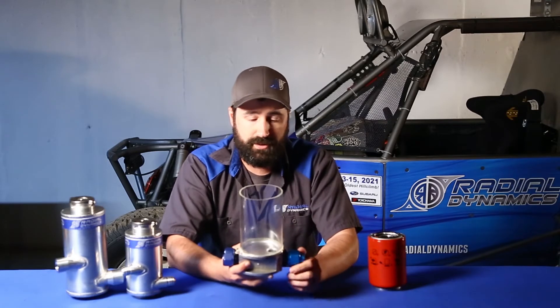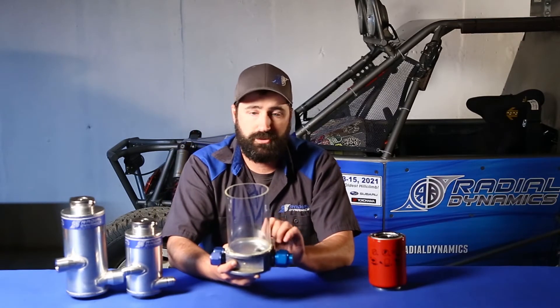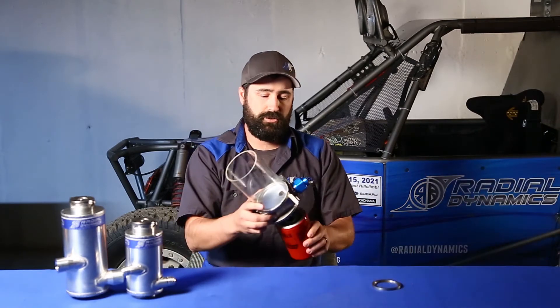It's more or less sitting there stagnant. The other downside is that if there happens to be any air or gas bubbles in your steering fluid, then as the pump operates, the fluid velocity going through this base is so high that any entrained bubbles won't have a chance to escape and rise up to the top of the reservoir. They'll just keep making that turn and heading straight back out to the pump. So today we're going to hook this reservoir up to the same water pump with the same control valve as the past experiment and see how this one compares.